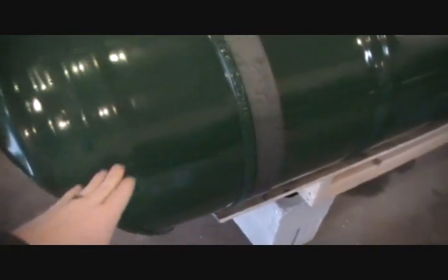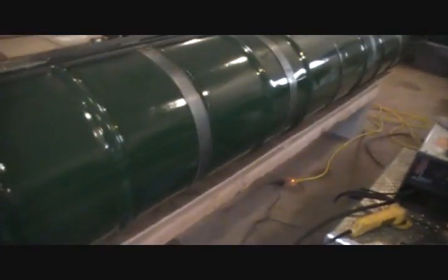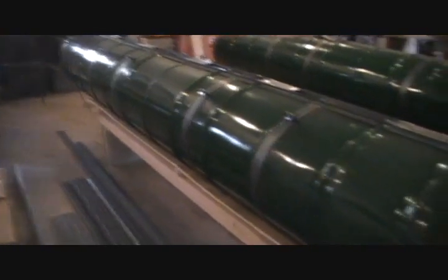And then you'll notice this is painted with the green paint that I talked about in the earlier footage. And then this was a test spot here. We're actually using a rubberized paint that's like undercoating for your car, like the chassis of your car. And what we'll do is end up putting two coats of this. The whole front will be covered here. And then what we're going to do is go about halfway high all the way around underneath. So it'll be plenty watertight. And then my biggest concern isn't water actually getting into the pontoon, because each barrel is individually sealed. I just want to add another layer of rust protection, preventing the rust from occurring. So that's the reason for the extra paint there.